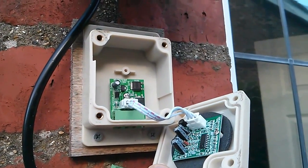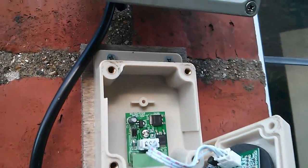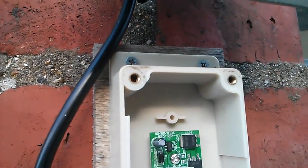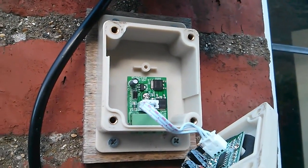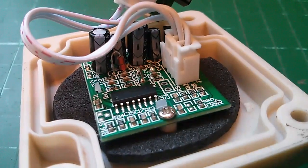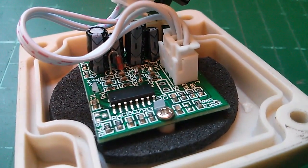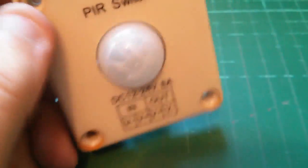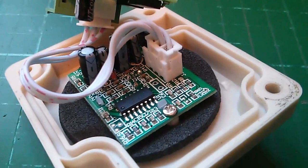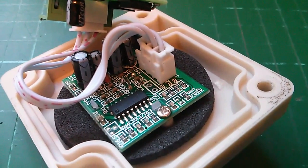Well, it looks remarkably unweathered. There's no moisture in there, and in fact there are no insects living in there either. That's quite remarkable because the little seal line — that plastic ridge here running around the unit — has gaps in it, so this thing's not sealed at all. I did do a little bit of weatherproofing on this though. You can see that circular piece of foam which seals the PIR cover, the sort of domed part of it. And those two connection points, just between the chip and the plug and socket, I think is where the CDS cell goes.